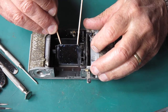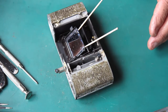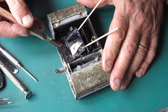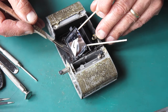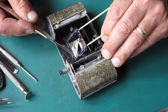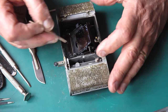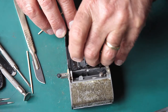I'll see if that mirror will lift on its tray. I'll just get a toothpick under there and see if it'll slide forward. I have to be very gentle doing this because these clips that are holding that mirror down in place — they're just a spring really — and if you overdo it and stress them it won't go well. Okay, that's all moving now. I'm just pulling that mirror forward and I can get it by the edge now.